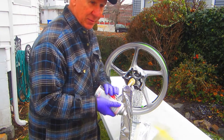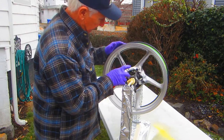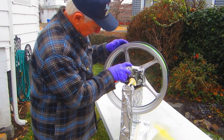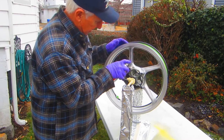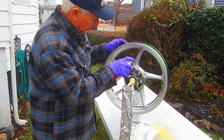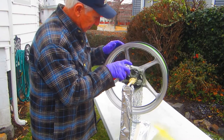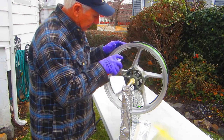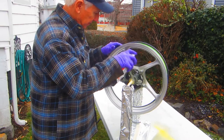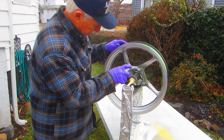There's just a little bit of snow on the ground — just like you took a salt shaker. We were supposed to get real snow last night; that would have befuddled our program a little bit. This area I know is going to be visible, so I'm trying to disguise the rough casting as much as possible. The trick with primer: don't try to put it all on in one big thick gloppy coat like you dipped it in a paint bucket. Better to just do little spritzes. The first time Glenn painted something here, it's always tempting to just keep putting it on.